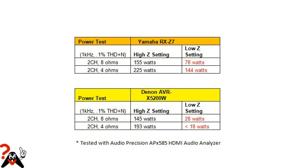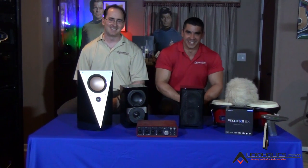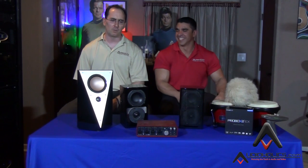When an amplifier clips, it gets distortion harmonics that go above the fundamentals, which is what blows out tweeters. So you're doing yourself more harm than good by flipping that switch from eight ohms to four ohms, regardless of your speaker impedance. Keep it at eight — don't starve. Listen to me now and believe me later. Don't be a girly man, leave it at eight ohms. Don't believe the bro science out there — I mean, it's just stupid.